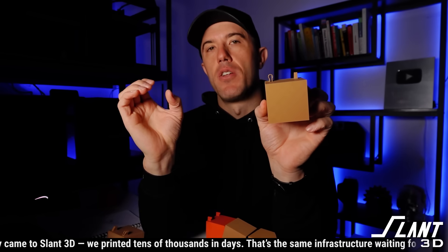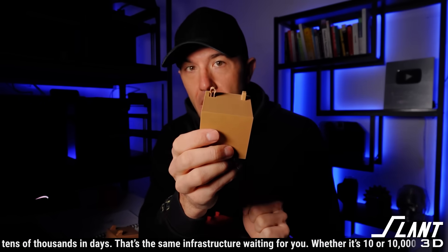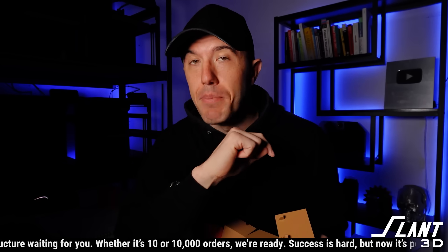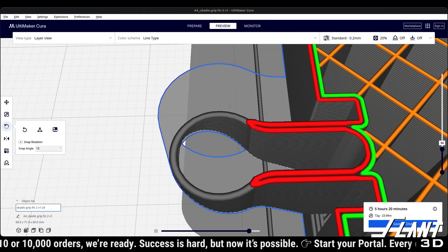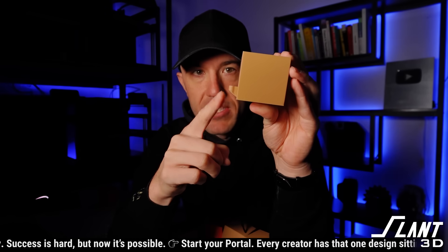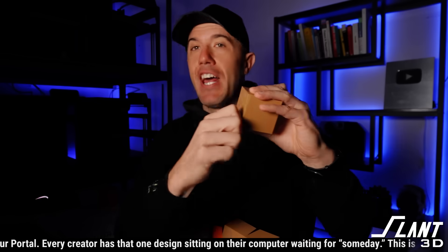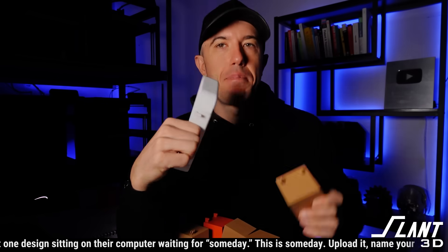This loop has a nice compressed single strand all the way around, long enough from the indent to hold up. It guides itself in there without anything that can really snap off. I recommend going about half a millimeter to one millimeter thick on these types of loops. But when it's that thin, you can have overhangs that start to sag. So you want to make the lower edge just as shallow or as vertical as possible while maintaining the dimensions you need, so you get something crisp and totally independent of slicer settings — and basically never going to snap off.